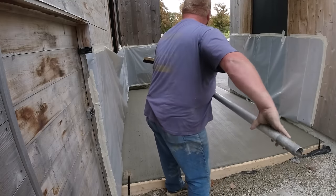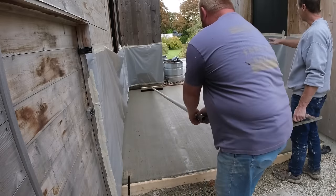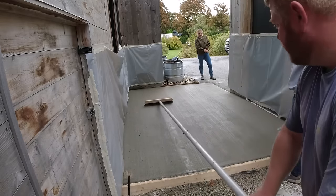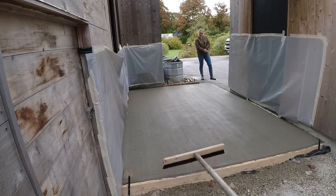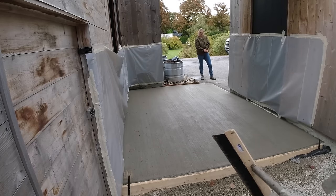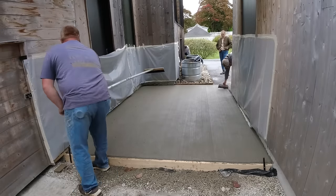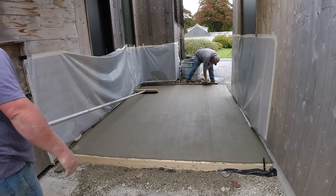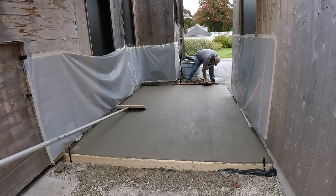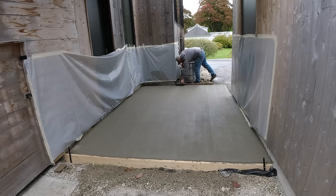It didn't take too many passes with the broom to finish this — it's a pretty small slab. I'm asking the woman from the architectural firm: do you want to leave a finished edge with the edger mark, or leave it just rounded with the broom — more of an industrial look, which is kind of what the architecture of the house is like? Darren showed her and she decided: let's just leave it rounded and broomed, simple and easy without the picture-frame-type look. Luke's going over one more area by the house because when we broomed it the first time the broom was dry and left some little concrete balls behind.